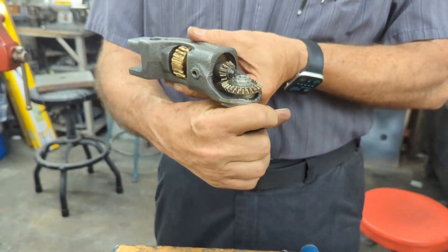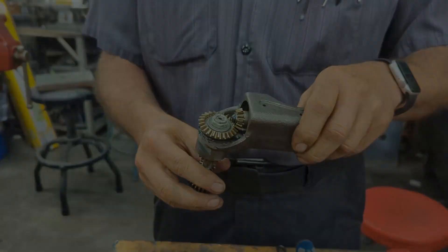The third reason is one of the tangs on the cradle itself broke off, normally the bottom one — usually that would happen if someone was shifting it without it being turned on and hit it so hard it broke. So those are the three reasons you would commonly do this. Let's go ahead and get started with the disassembly.